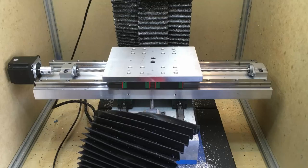To describe exactly what's going on, here is the x-axis of the mill with the chip guards taken off. You've got the stepper motor, which connects through a shaft coupler to the lead screw, and then that has two different bearing blocks with bearings in them attached to the lead screw. The purpose of the bearing blocks is to allow the lead screw to rotate, but to constrain any other movement — any translation, and also axial movement of the lead screw.